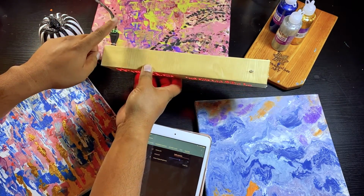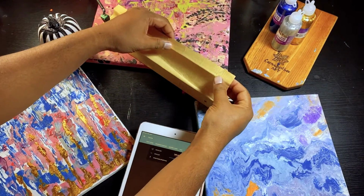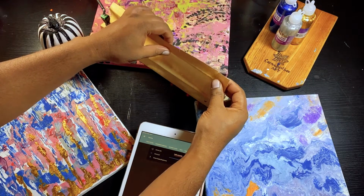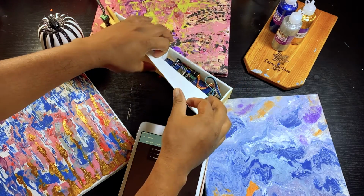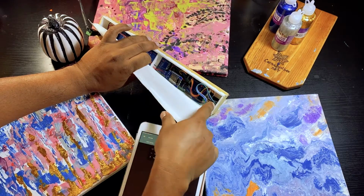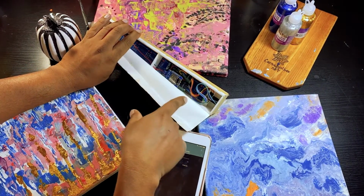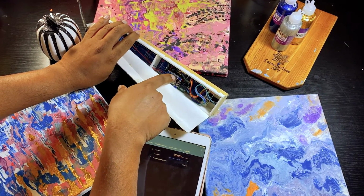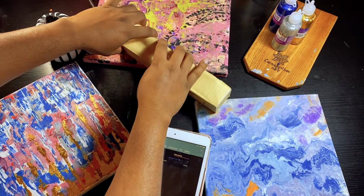Here, I'm just giving it a 5-volt supply. This is just a veneer paper. It's actually really thick paper that has a print of a wooden kind of material on it. And you can see this is the ESP8266 that is connected to two dot matrix displays. And the ADC is over here, connected to the ADC port of the ESP8266. This is very simple, just two things.